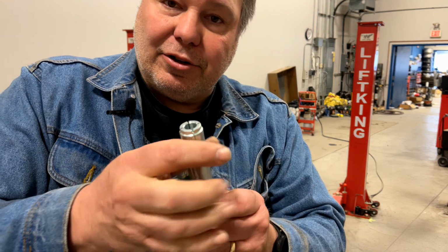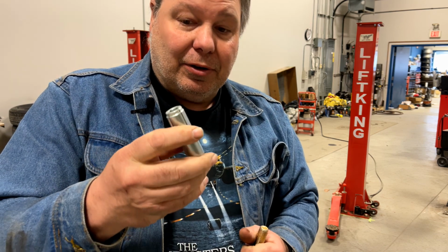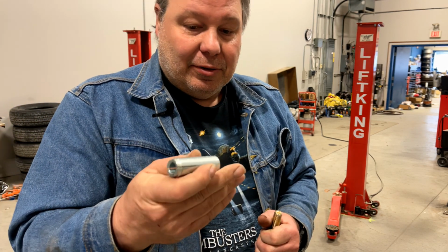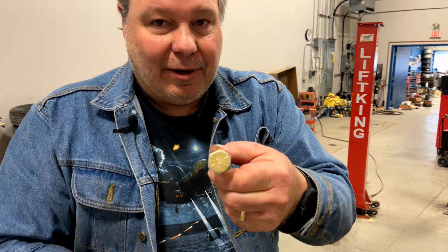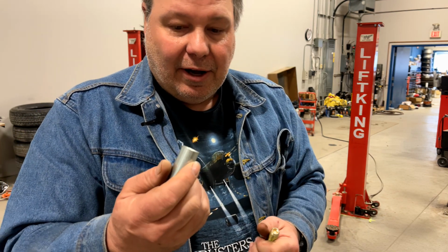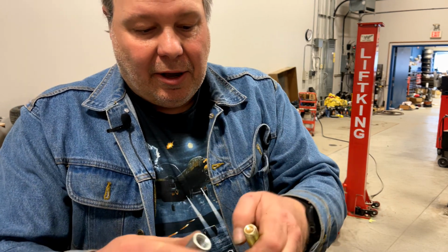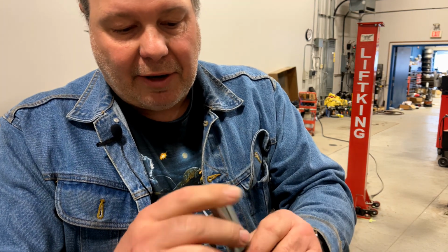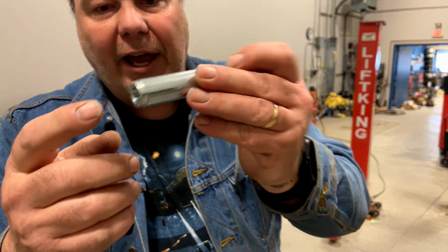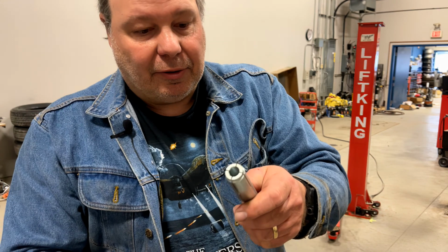So they look like they're shorter, they look like they're less heavy duty, but he assures me, and I'm going to assure you, this is a way more solid way to do this. It's still a flush mount anchor. This uses a high grade Imperial bolt. It's an Imperial 5/8 concrete anchor. And inside, when it's shipped, there's a little plug there. When you tighten this thing down, it forces this slug inside down to the bottom and expands these much heavier duty arms into the concrete to hold it in place.